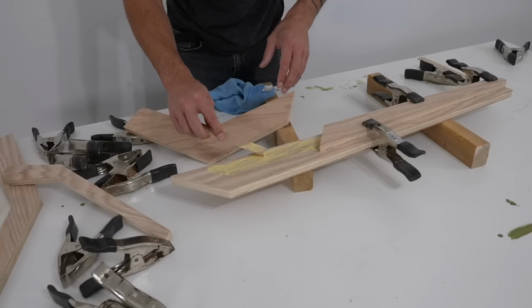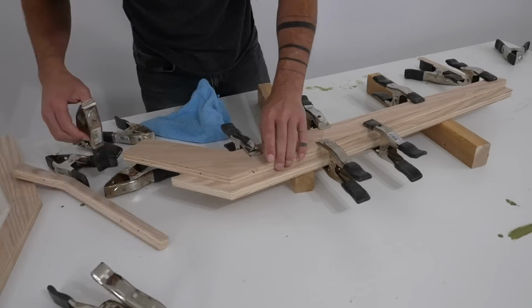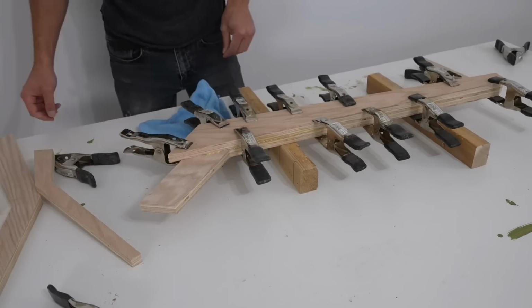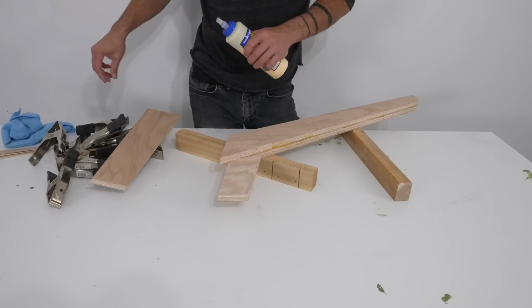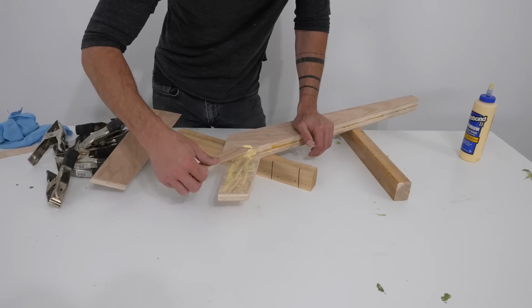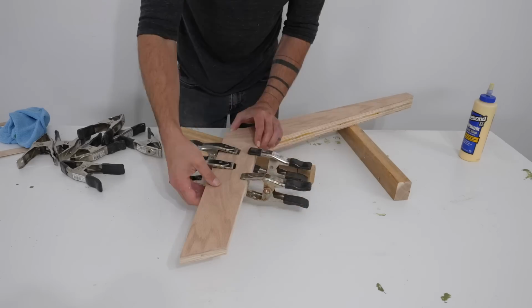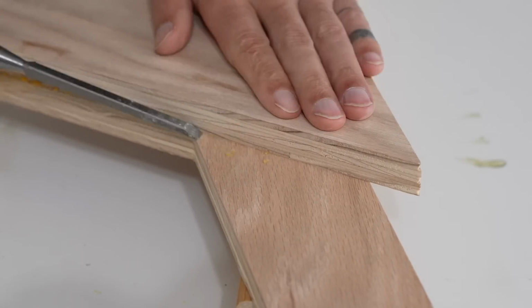The structure for the chair is made with 2 layers of 3/4 inch plywood. These side panels that give it its profile are made with overlapping pieces. This approach allows the chair to be made with a relatively small CNC machine, but more importantly, I like this approach because I intend to make templates so that these chairs could be made entirely out of scrap wood using just a router and these templates.